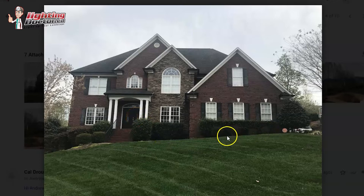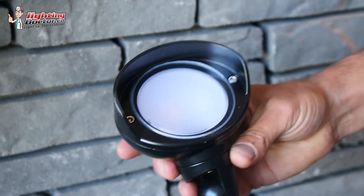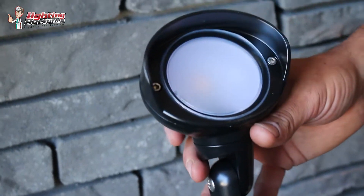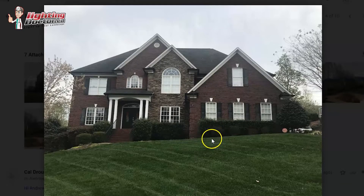For the front level, I'm a big fan of lighting the back, but you will have a bit of a dark spot there. A wash light works well in those cases — especially on lower-line shrubs. A wash light is similar to an accent light but not as bright, not as intense, and has a wider angle. So if you have certain areas lit in the back, I might add one of those wash lights here and maybe another over here.